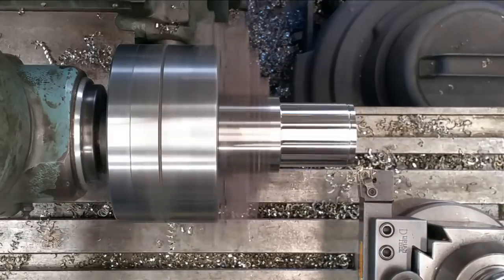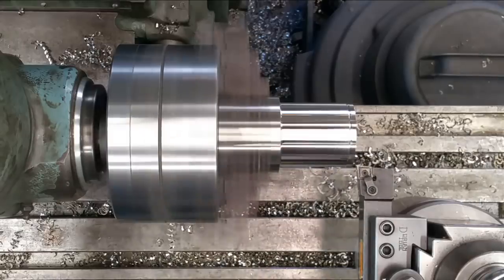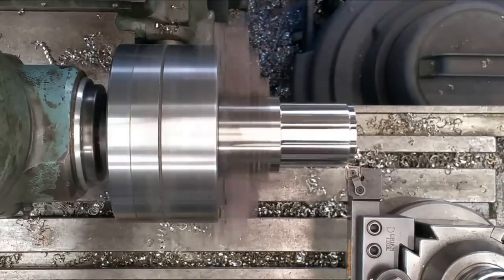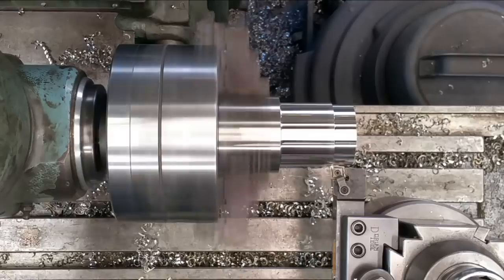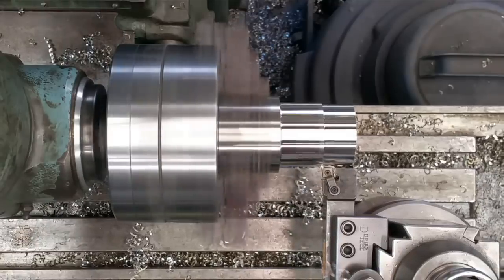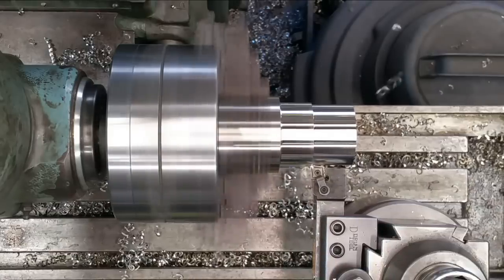Okay, we're going to take it 50 and we're going to jack up the feed rate just a little bit, 4.5 inches a minute. All right, that's a good load on the K&T. That's optimizing, it's breaking pretty good. It's got a pretty good finish right there.